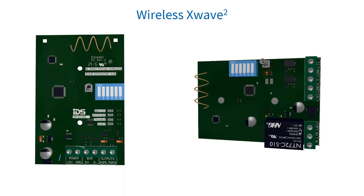X-Wave 2 LEDs: there are four LEDs on the X-Wave 2 board marked Beacon, Network, Trouble, and Alert. Beacon will flash when the X-Wave 2 hub is transmitting information. Network indicates bi-directional network information — the LED will be on in normal operations with no errors. Trouble indicates troubles with the hub connected to the X-Series bus — the LED will be off if there are no troubles; if there are errors it will pulse the error number. Alert will flash when the X-Wave 2 hub receives a message.